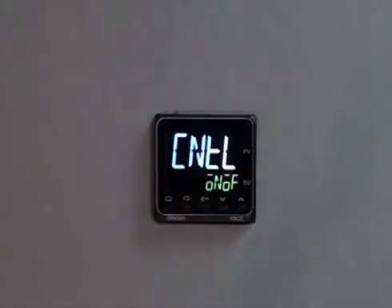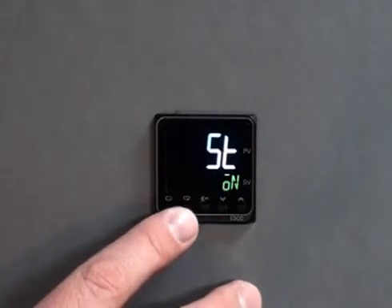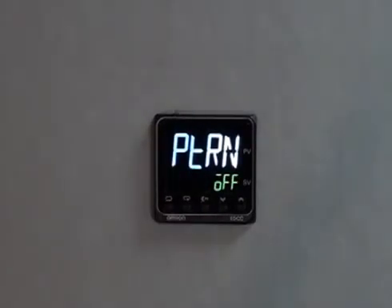We show a control input. This control is there to set an on-off control of the temp controller or, by pressing the up arrow, allow us to transition into the PID control portion of the temp controller. For this example, we will leave it set for PID. As we continue through, we see additional high-level set points or patterns. These settings can be utilized depending on the application requirement, and other options will become available depending on your choice of thermocouple.